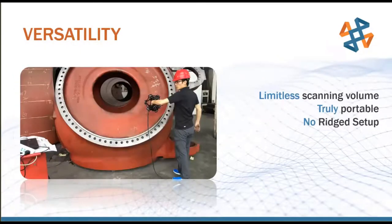The benefit of this system, as well as all the other systems we've talked about so far, is that they're portable. So we've got this very, very large casting part sitting out on the shop floor here. It's a lot easier for me to take my scanner and roll my scanner out to that part to take measurements than it is to get someone to get this part back into my quality lab so I can take measurements on this. So whether that's out on our own shop floor, or maybe I'm going out to a customer site and I need to get in a car or on a plane, I can take this scanning equipment with me and take my measurements there, as opposed to having to move the part around.